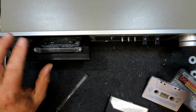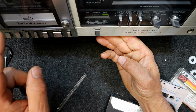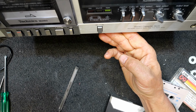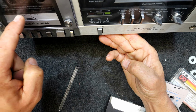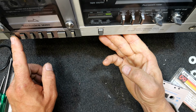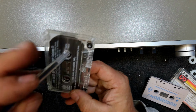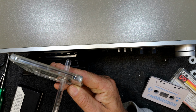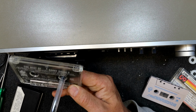That is so weird. To actually see it pull the erase head is the weirdest thing of all. Though it's not doing it with the big reel on that side, it only does it with the big reel on the take-up side and the small reel on the other side. It's about 1 RPM on the small reel because they're going at quite different speeds. So it seems to happen once with every turn of the small reel. Is there a lump in there? Or is it moving around in the case maybe? I guess that's what it is.